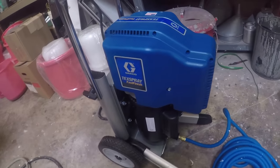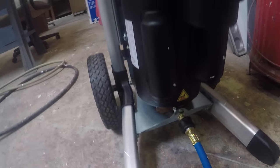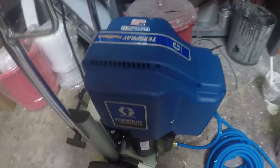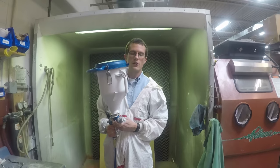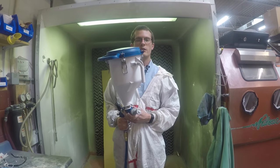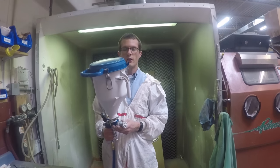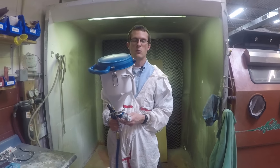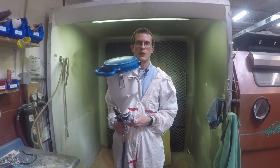It's well built and heavy duty. These would be the Fast Finish, and then you move up to the RTX which has a hopper on top. If you're looking to spray both paint and texture from a single unit, you could be looking at the Mark series of sprayers — the Mark 4, 5, and 9. The main difference is those units will allow you to spray regular paints well; you can put a standard airless gun on them, and that's what they typically come with.